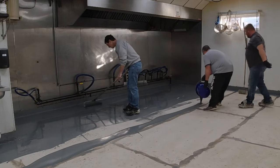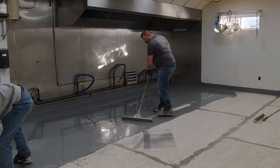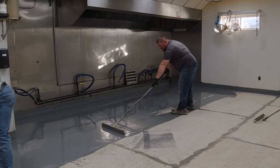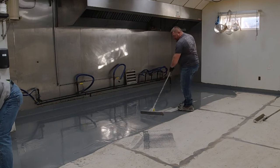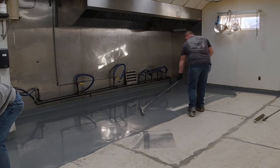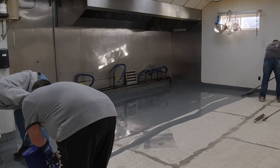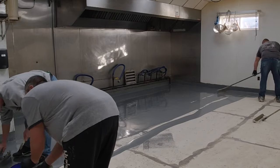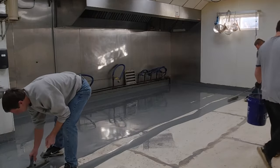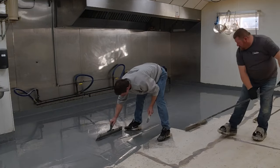What's great about urethane cement is it can resist really high heat, so you can clean these floors with really hot water and it's not going to damage the coating. They're basically bacteria resistant. Versus an epoxy floor that could be damaged from bacteria from food processing sitting on it — with urethane cement floors, that's not going to bother them at all.